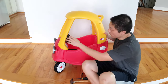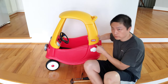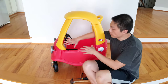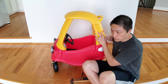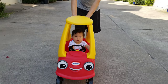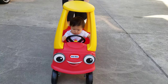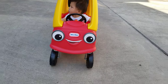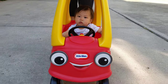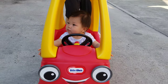Also regarding the pillars: it might seem easier to do the back first because you have to line up a nail and knock it into place, but according to the instructions you need to put the front pillars in before you do the back. I tested both — it's easy to put the back first, but then it's impossible to put the front in. So do the front pillar first, then knock in the nail for the back pillar. Having two people is not necessary but it's nice, especially when pressing the back pillar down to get the nail in. Take your time and read the instructions a little bit ahead.